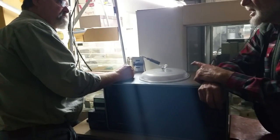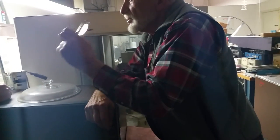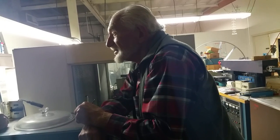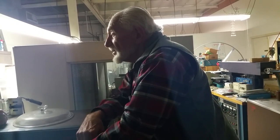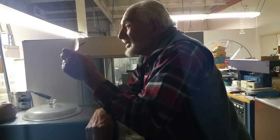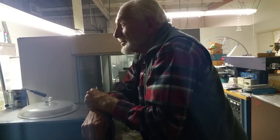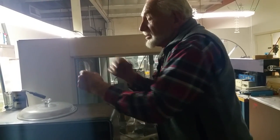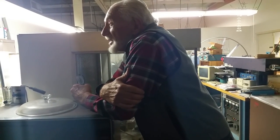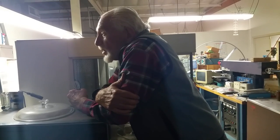If we introduce that into the bowl, by the time it gets to the bowl it's only at 50 microns — 100,000 times less dense. The amount of actual gas in the whole bowl at that time, because it's such a vacuum, the volume of that gas is only as much as a drop of water — the volume of a drop in the whole salad bowl, because the vacuum has expanded it. So the energy, the calories of the gas at the plasma level, is way, way down.